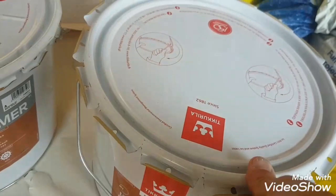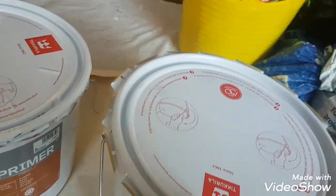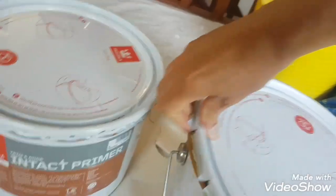Basically with this system I've used — and this is over old woodwork as well, old glossy alkyd woodwork — for a water-based paint, that is nice and thick. It's a nice drop of stuff. I would always use one primer and then two top coats, because as you see this door here, it's got a lovely shine. It's the best water-based paint I've used so far — really comparable to a solvent sort of product.